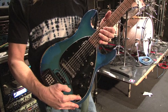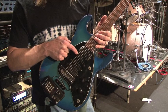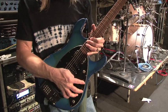In the up position, it adds this single coil pickup to whatever you've got selected here — it adds it, so they're in parallel. In this position, it's only this pickup. Basically, it's something I put in there for recording more than live use. So I leave this down.